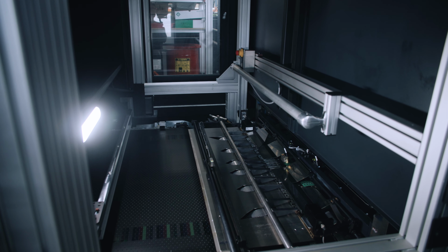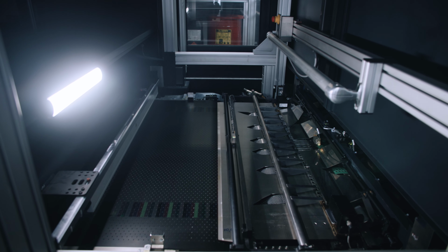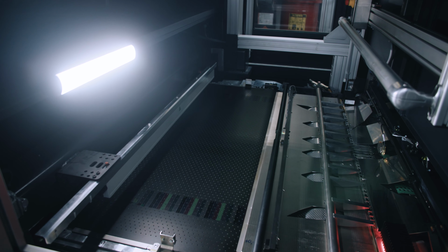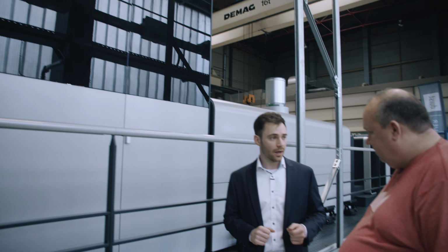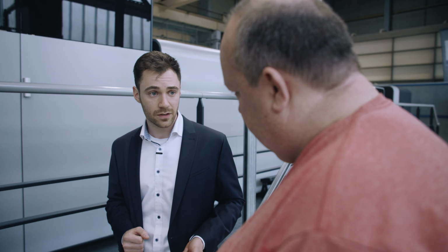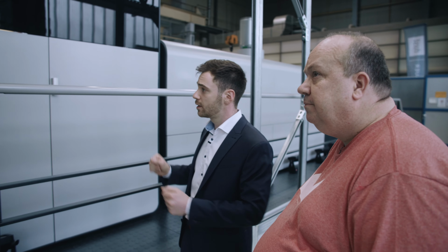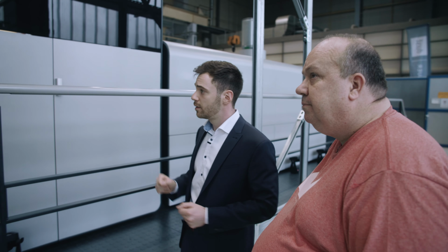But now we have the sheet on the belt, and just behind us here, we basically have the print bars, right? The print bars, exactly. So the sheet is now on top of the belt and running through the print heads, and we've got 7 colors there: CMYK, orange, violet, and green, to reach a high color gamut which you need for folding carton production, right? Yeah. And all our inks are water-based, so they comply with food applications, and with those inks we reach very high print quality. By the way, also here we used market-proven technology because we implemented the existing technology from Durst, our parent company, and put it in here, to ensure we're just using market-proven technology which is reliable and working.